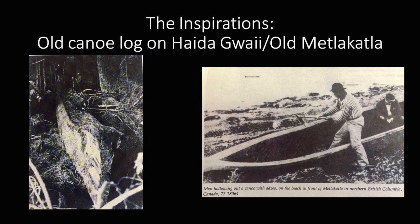You can see that the outward curve of the log has been retained because you want to keep that outside surface just under the bark — it's the newest, most live, most resilient, most responsive wood. Especially when you go to bend it out by steaming, you really want to stay in that prime wood. This shows you exactly what that carver did in probably the first few days or maybe as much as a week of work.